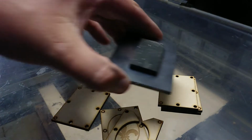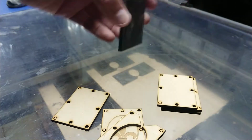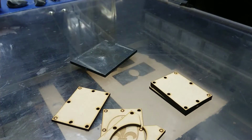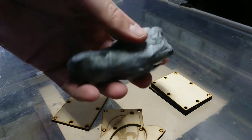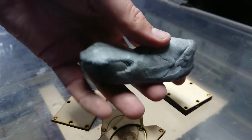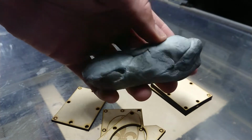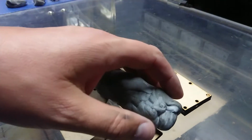I've also got this big hunk of steel which I thought might go in the vise to help reinforce one end. I'm going to try 2 at once. I'm going to see how we go. I'm also going to use blue tack here as the extended pouring sprue, or I don't know the actual terminology here. I'll have to work that out later. This holds up okay to the 500 degrees or so of white metal. I don't know what it's going to do under 1100 degrees, but I'm going to be well out of the way. And I'll show you a couple of precautions that I've made.